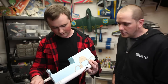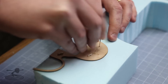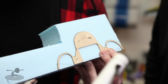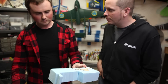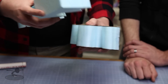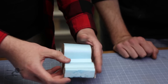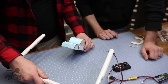If you're going into a crease, make sure that if you hit that crease on one end before the other, you carry it beyond — always have momentum, otherwise the cut won't be as nice. The piece I'm cutting is short, so it's not bowing much. The template needs to be stationary — I use T-pins, or building needles. For thin templates I hot-glued them, and hot glue is nice because it melts when the wire goes through it.